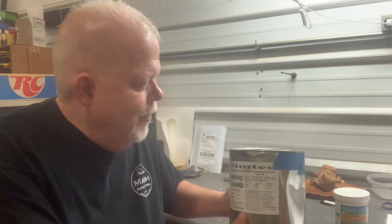It's a polyester sealer. I know you think polyester, but I'm telling you, it's all about being thin. We usually do a couple good coats, let that set for half a day, come back with another good coat, let that harden up good, sand that down with some 220 on a DA or whatever type of orbital sander you have, and then come back with some more coats until all your pores are filled.